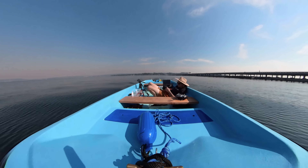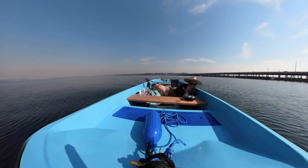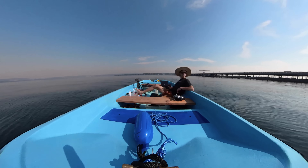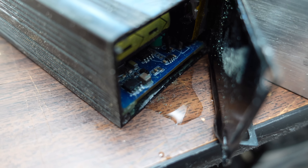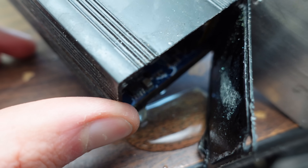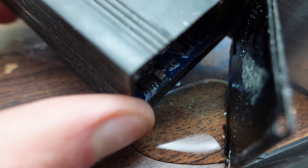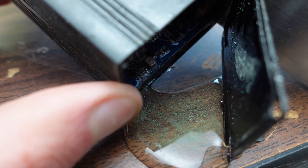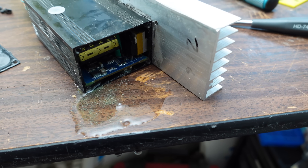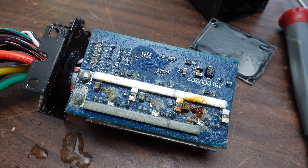Over the next few months I started having problems with the motors stuttering and turning off randomly, so I did an inspection on the VESC 75-100 motor drives. I opened up one VESC that was not working and water poured out — I have no idea how it got in there since it wasn't even getting splashed on. It was completely full of water.